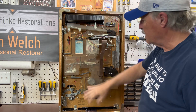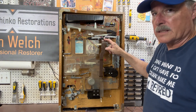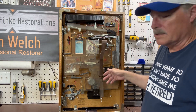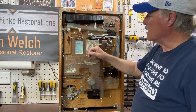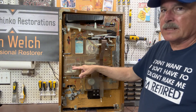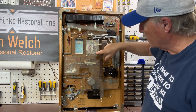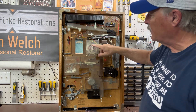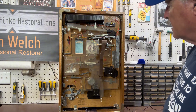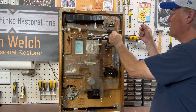So all of that had been redone. I put the 12-volt power supplies in. Obviously this has all been cleaned. The center attraction cover was missing, and the seesaw cover was missing — these are not necessary and are quite often missing, but I happen to have spares. There is a light that goes inside that cover, and it helps hold it in place. We got all the covers back on, got it all rewired, added the 12 volts, and it's looking good and ready to go.